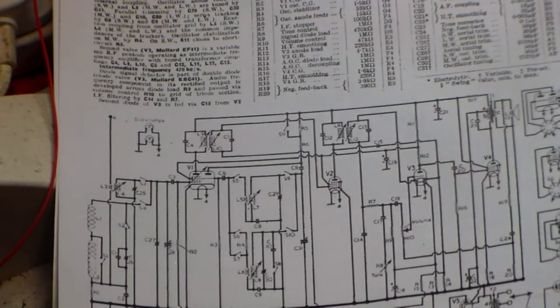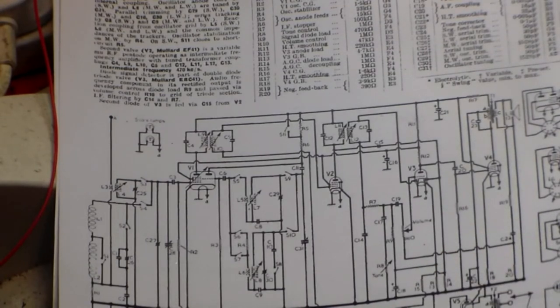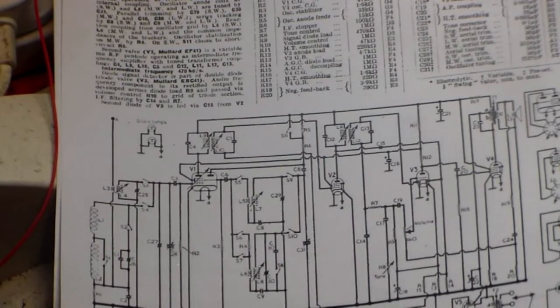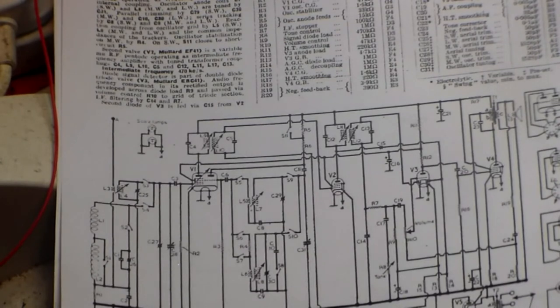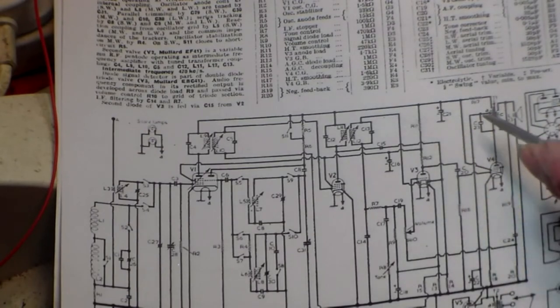That's the difference. Okay. After the rectifier, of course, the next thing you look at is the smoothing capacitor. Now, the smoothing capacitor on the P75 here is a large can on the circuit, and that contains two capacitors. One is a smoother, and one before it connects with the valve, and that is a reservoir capacitor. They are in one can, and one of them goes straight off, that one here, and of course the other one goes there. Okay, one before, one after in this case, but again it varies from set to set.